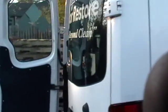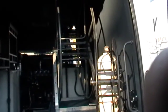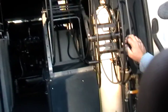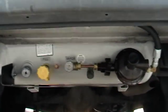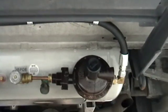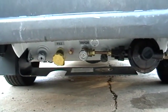Let me open this up — it's really nice. PowerClean did an outstanding job, an amazing job with the workmanship of this inside. It's really something else the way it's detailed out. It's got an electric reel here and a water softener right there. We mounted the heater right here and put the propane tank underneath the back — you can see that under the rear. That propane tank holds about 12 gallons and burns about a half gallon an hour, giving about 24 hours of trigger time before he needs to refill.